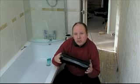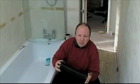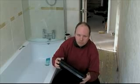Unlike any other underfloor heating systems, there are no cold spots between the elements or the pipes or whatever. So it's a very even heat, which means you can run it a little cooler than you would on another system, but still get the same warmth in the room. Here's another clever bit. If it gets too warm, the resistance within the polymer changes and it doesn't draw any more current. It's self-limiting, it's very safe, it's never going to overheat underneath a piece of furniture.